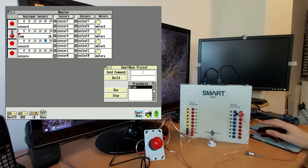On the outputs here I've got a lamp connected to output seven, which I can switch on by clicking there. Alternatively, I can control it by typing in commands — so I can switch off lamp number seven, or make it flash by doing switch on seven and making it pulse on for 50 centiseconds, off for 50 centiseconds. That now flashes away, and then I can switch off all to switch it back off again.